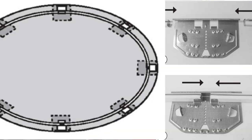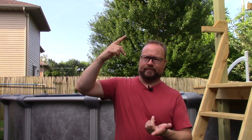Then you're going to assemble that bottom track and lay it out with all those caps. To help keep the center point, I used a half-inch by three-foot steel rod which I drove into the ground at the center of the pool, leaving about a foot and a half sticking out. That lets you measure your radius of 10 and a half feet all the way around — a really good way to make sure you're perfectly round when setting that base track. You're going to need two people for that part.